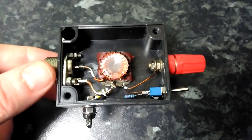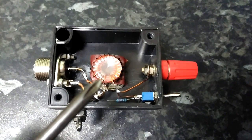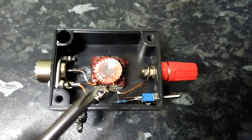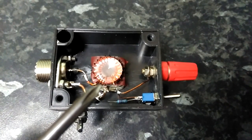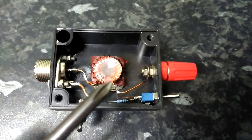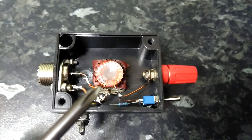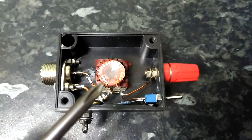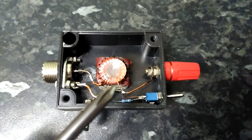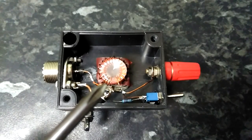But if you're ever wanting to copy this idea: T68-2 core, so that's the red core. We're looking at three primary windings and a total of 20 secondary. I've done this as an auto transformer — I won't go too deeply into it — but because it's done as an auto transformer there's only a total of 20 turns. Effectively, electronically, this will see 20 secondary, 3 primary.